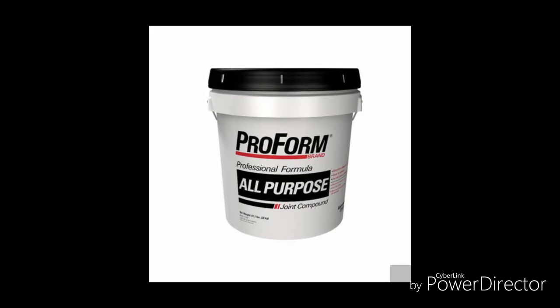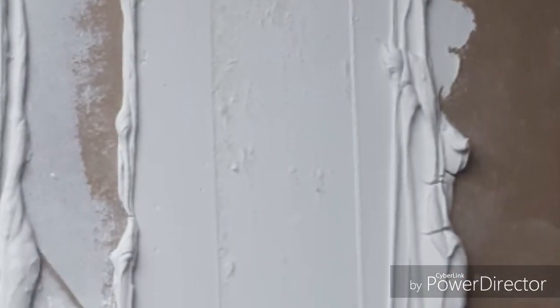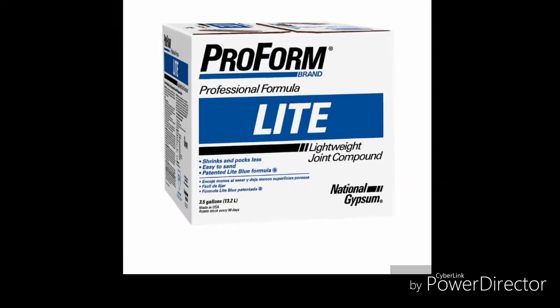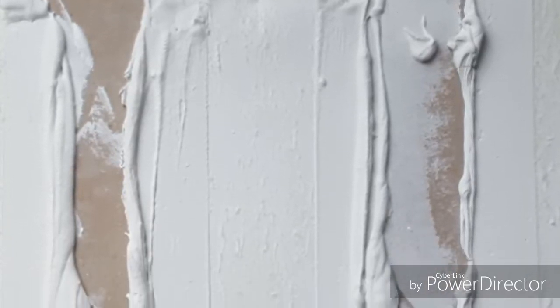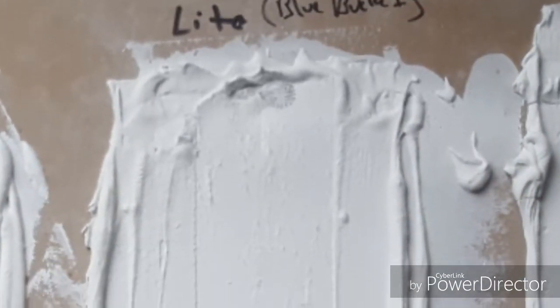This time we're looking at Proform by National Gypsum. Surprisingly, the all-purpose mud — which is usually used for taping — look at that: so much of it came off clean. This is by far the worst result I had with any compound. This is black all-purpose by Proform. You'd usually expect to do well with an all-purpose compound, but the results are otherwise. Next, looking at the light blue lid by Proform — the results are actually better than the black, but still not great, nowhere near as good as the USG compounds. A lot of that tape is off pretty clean — you can see plenty of shiny spots with very little fuzzy paper.